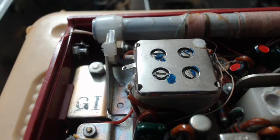Now, I probably should keep this radio just for the germanium transistors, the special tuning, the special coil that synchronizes with the long ferrite rod, because it's a long distance radio. The tuning cap goes to the big long ferrite rod. It also goes to a secondary coil after the amp, so that the front end is tuned, and then it goes to another one by the mixer, and then one of the sections goes to the oscillator. And even in the old days, you could not get that capacitor in the store.